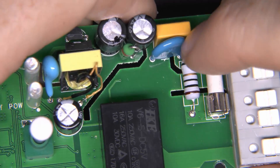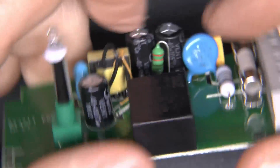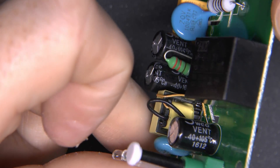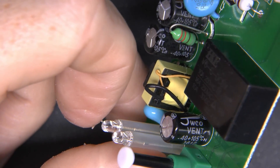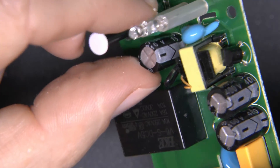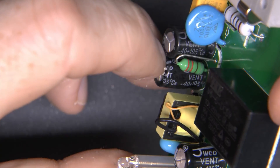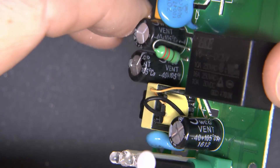And again, there's a resistor going across the two, which also goes over the slots. Capacitors here — I don't expect those to be any fantastic name brand, but they are at least rated to 105 degrees, so that's slightly better than the 85-degree versions. It says JW Co on there, apparently. Rated 400 volts, so that's pretty much what we want with mains voltage stuff, because although the voltage is 240, the peak voltage is actually near to 340, so you certainly want anything to be rated well above that. So 400 volts in this case — that's fine.